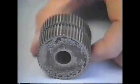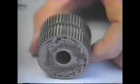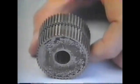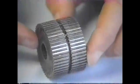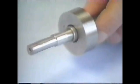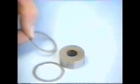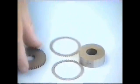Here we see a single-stack segment removed from the rotor shaft. Its teeth are designed to line up with the stator teeth on the outer part of the motor. The black epoxy on the end shows the rotor assembly on this particular motor is bonded, not riveted. There's a slot in the middle created by a spacer. Within each stacked segment is a single permanent magnet, which gives the motor its direction. The entire assembly is pressed on the shaft. The reason these motors are called hybrid steppers is because not only do they have the permanent magnet, which by itself is enough to make a motor from, but they also have these punched laminates which improve performance by focusing the flux from the magnet.